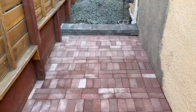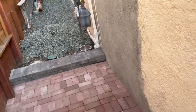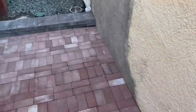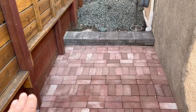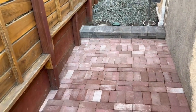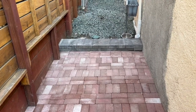It's all done. It's sloped up towards the back and down towards the driveway, so any water will run down. It's also sloped about a half inch from the garage to the fence so any water will run out, and if it doesn't, it'll go through the cracks in the brick and into the French drain. Another completed project. Good luck if you choose to lay brick — just do it carefully, take your time, and it'll turn out good.